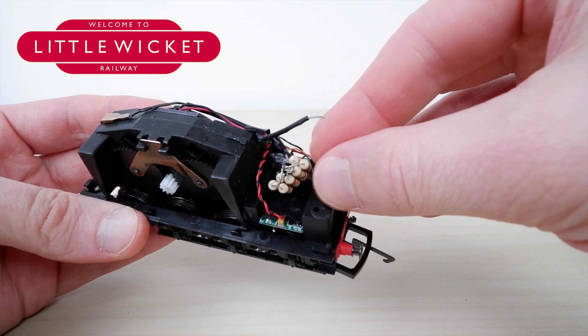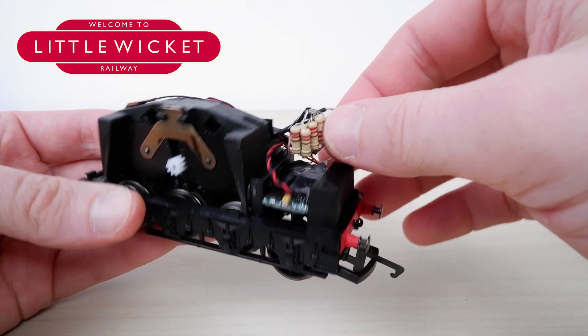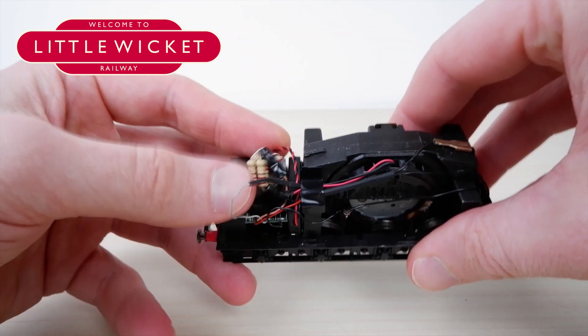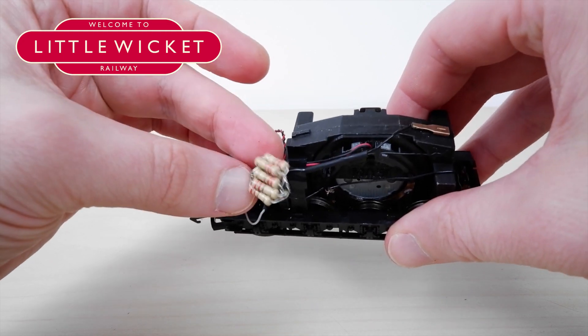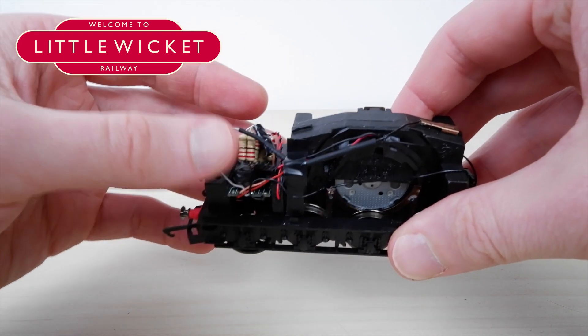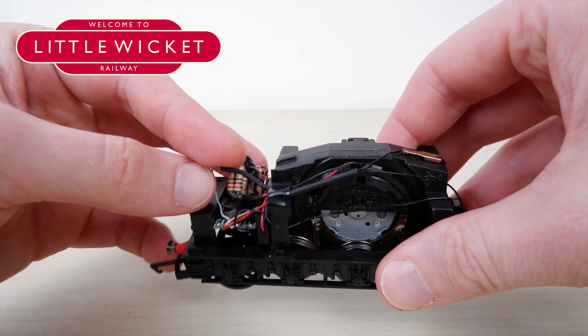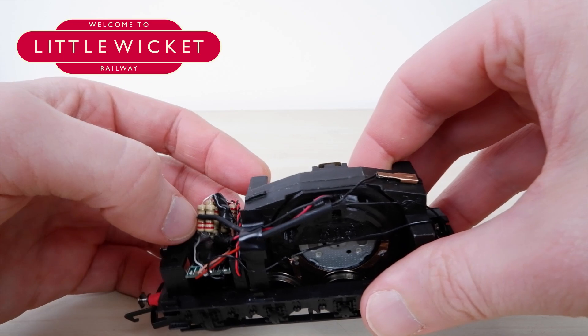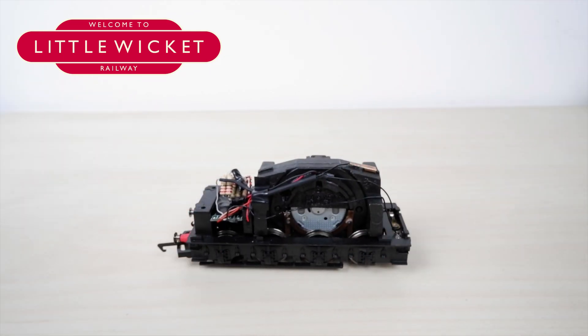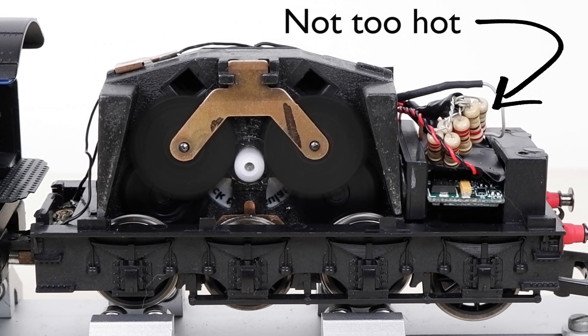After much experimenting I came up with this not very elegant solution. It's eight 220 ohm resistors in parallel, which effectively gives a 27.5 ohm resistance. Why eight of them rather than a single resistor of a similar value? It comes down to the power they can handle. The resistors potentially need to get rid of one watt of power, which is quite a bit and a single resistor would probably get very hot. But because we've got eight of them each rated up to half a watt, they can share the load — and having tested this, they get slightly warm to touch but I'm not concerned they're going to melt anything.